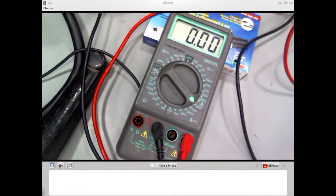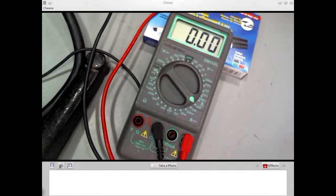Just to remind you what this looks like when hooked up in series: the 100-watt bulb is barely glowing — if you stare at the filament, it's a faint orange. The 40-watt bulb is a nice soft color now, but not as bright as before; it's certainly brighter than the 100-watt bulb. James and Rachel, what did you get for R_total, and how did you get it? We got 547 ohms — just adding. Yes, they're in series. This is the easy case for resistors — you just add them together. Anyone want to dispute that?